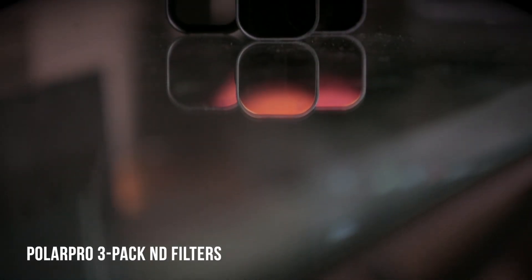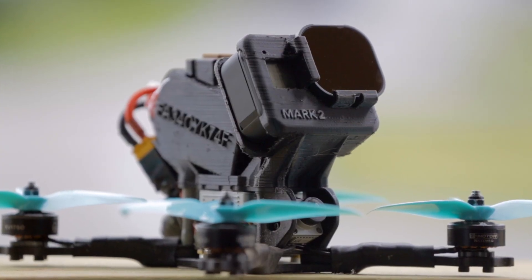We'll have to do a whole video about camera settings, but when flying FPV drones it's really important that you're shooting at the right shutter angle so you get the right amount of motion blur. GoPros have a fixed aperture, so you need to compensate with ND filters. I went with PolarPro's magnetic ND filters — they work great. They come with an 8, 16, and 32 stop, and I use all three depending on cloud cover. Only at the last little bit of light am I able to fly at the right shutter angle without any ND filter at all. The only advice I'd give is that because they're magnetic, they can pop off during jolts like hard landings. To remedy this, I put little tabs on there that go over the sides of the two corners, so I rarely ever lose ND filters now except in really catastrophic crashes.